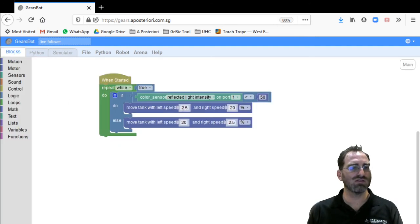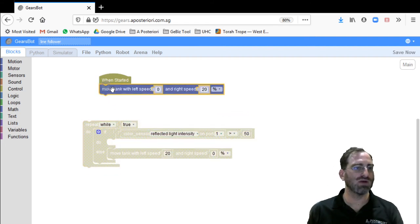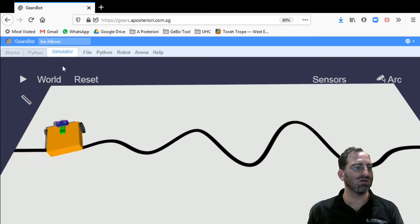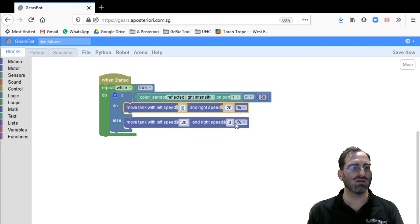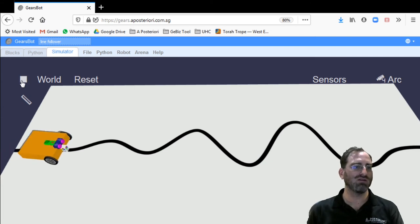Now, if we think about the geometry of the turns, and we're getting so low here, we can think about what happens when we turn this to zero. What we noted before is that when you do this, the robot turns just about around the stopped wheel. We can see the geometry of that turn. It looks like this, right? That's pretty much the smallest circle you can circumscribe for this robot, by just turning around one wheel. Let's see what that looks like when we use this type of turn in our algorithm. We'll lower the speeds on the slowest wheels to zero so that we're just turning around those wheels themselves. Now the ratio of speeds is no longer material. We've changed the geometry of the turn completely so that we're just shimmying forward.